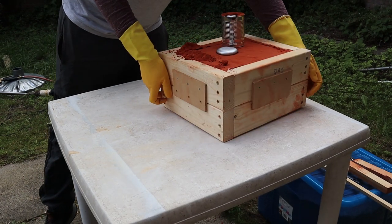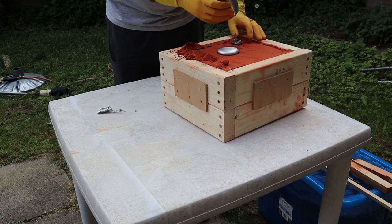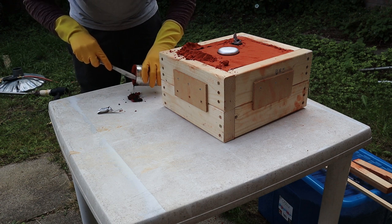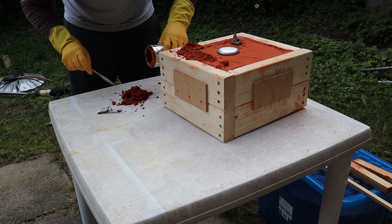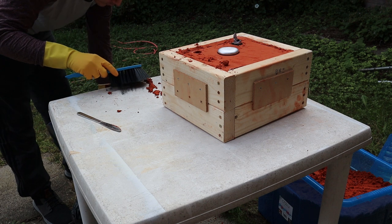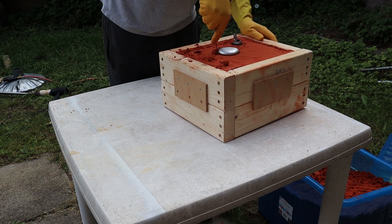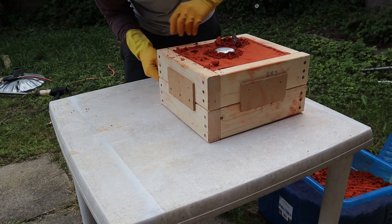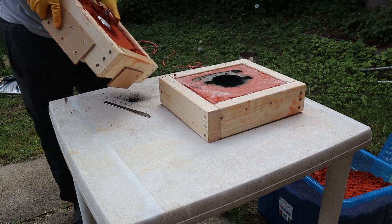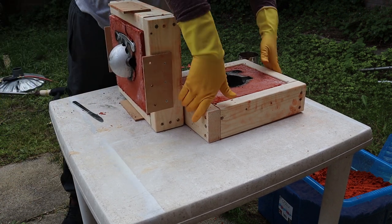The next day, and it's time to demold. The oil in the sand burns at high temperatures, so any burned bits of sand are not usable again. Here I'm carefully separating the good sand from the bad sand. Initially, it looks promising.